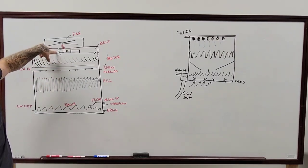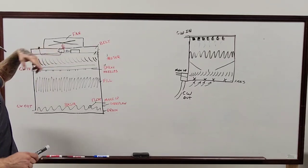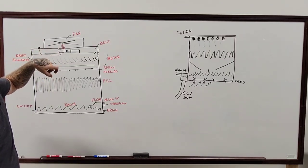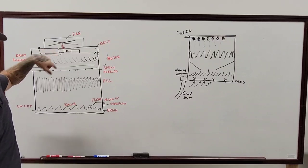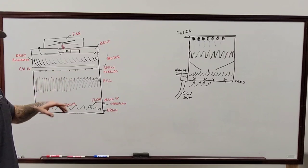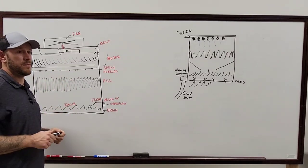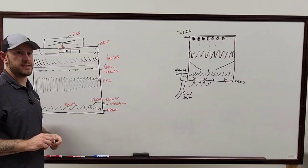There's a 90 most of the time on the back of those gearboxes, and it has a cap in it. You can pull that, stick your finger in there to check the oil. There's also another cap right below that. That's for the drain only. Don't pull that one. You will not get it back in before most of that oil comes out, I promise. And then you're going to fill up the whole tower with gear oil, and it's nasty and bad.